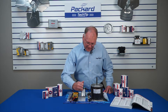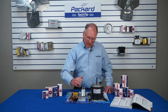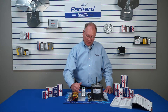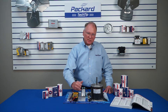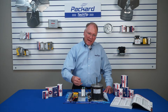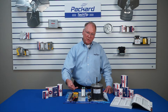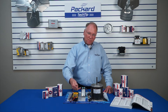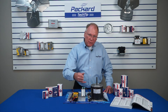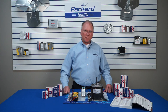On the Titan HD capacitor, this shows 440 slash 370. This is a 440 volt capacitor. That particular capacitor has 370 on it for the assurance to the technician that it is okay to use this capacitor on a motor that calls for 370, but it is a 440 volt capacitor. Always put the correct microfarad rating on the motor that the motor calls for, but you can go up in voltage over what the motor calls for.